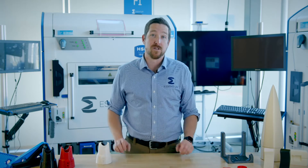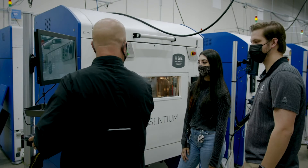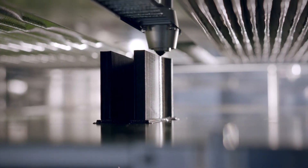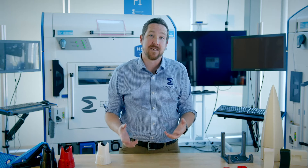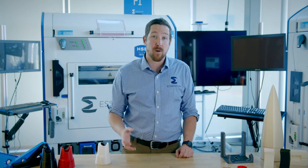The third feature is TPU-58D's variable damper properties. Users can adjust perimeter lines and infill percentages to create parts that can be stiff or springy, depending on the requirements for the application. This is ideal for ergonomic applications since parts can be customized to an individual's personal preferences. For example, if an employee repeatedly performs a task that involves leaning, a TPU-58D damper pad can be printed with a low infill to act as a durable, anti-static cushion support.